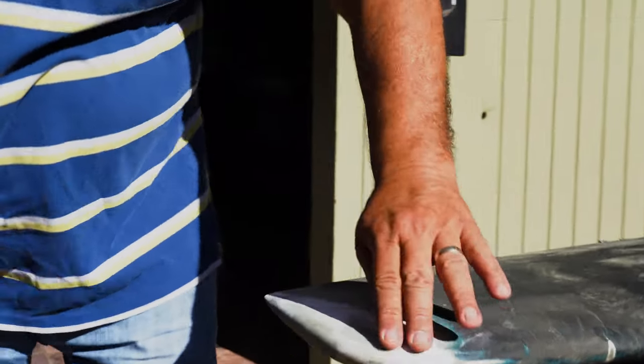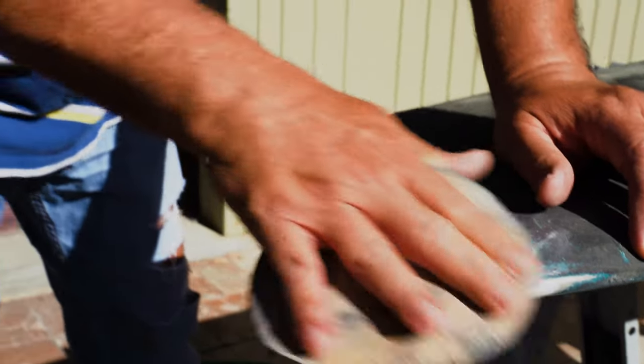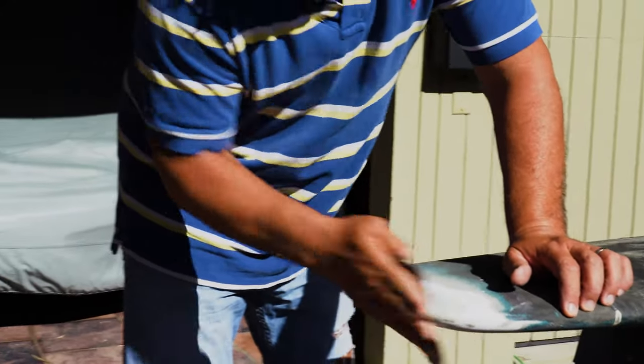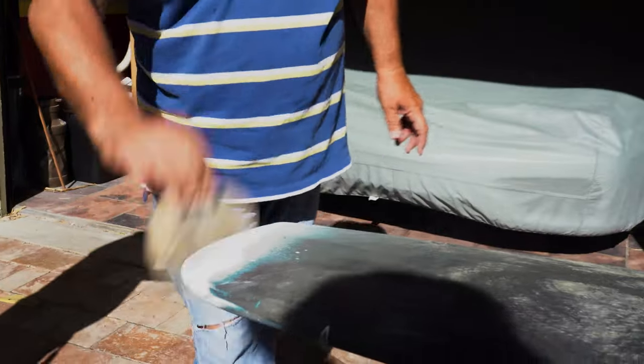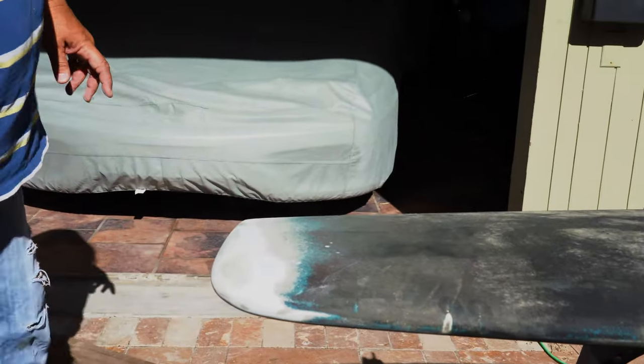What's the difference between this and fairing compound? So fairing is epoxy, but it's in a thicker paste. When you're sanding round shapes, it's better to do it by hand, because your hand will copy the round shape. Right. All yours.